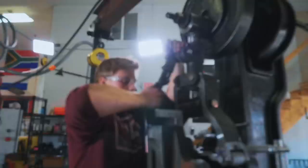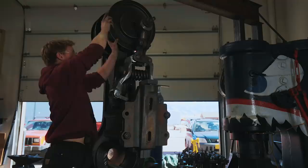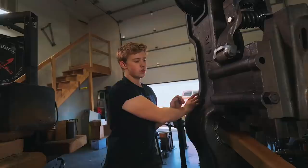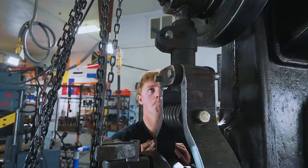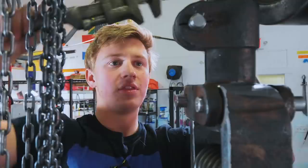It's still sticking — I can't get it to do a full revolution. I've got the ram blocked up and I'm going to let the pitman adjust side to side. As I spin the flywheel, the ram starts to bind in the guides because it isn't being pulled up square. If the ram is binding, the hammer is functionally unusable, so we're going to loosen the mechanism so it can self-adjust. My friend Kevin Willie suggested shortening the stroke a little bit. Before we took it all apart, Kevin called back and suggested checking that the wrist pin is square with the dovetails — it makes sense that this would be the part to fail since it's the smallest and weakest part on the whole hammer.